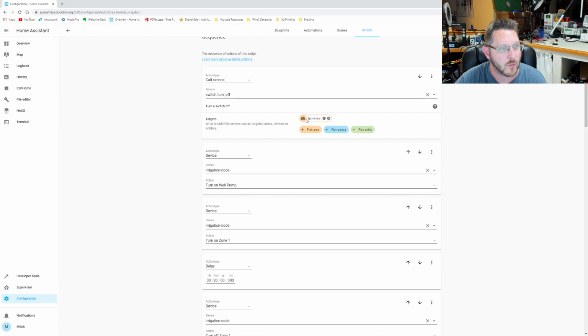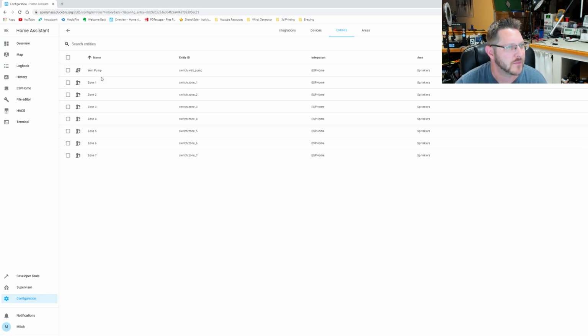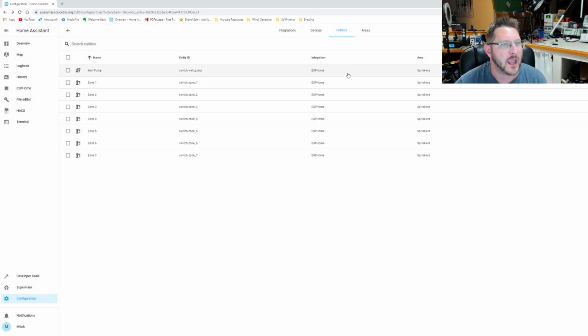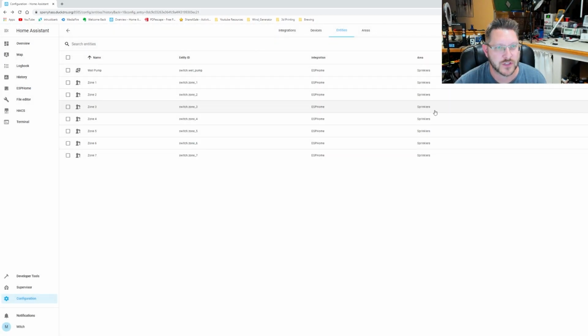And I said, all right, we're going to turn off sprinklers. I did it by area. Okay. And so how you do an area is when you have your entities, let me go back. When you get your entities, you can select what area they're a part of. So down here in advanced settings, you can create an area, and I created an area called sprinklers. Okay. And so I assigned each and every one of these entities to the sprinklers area, as you can see here.